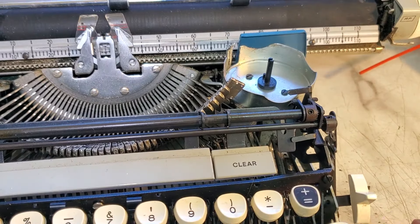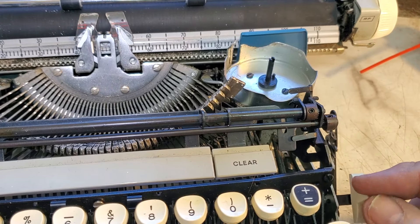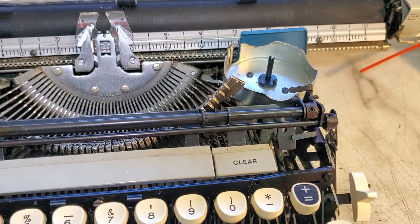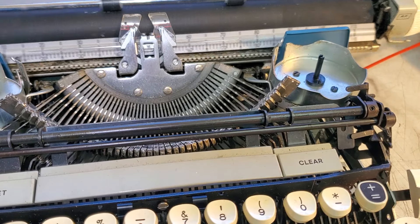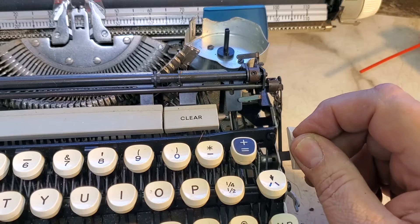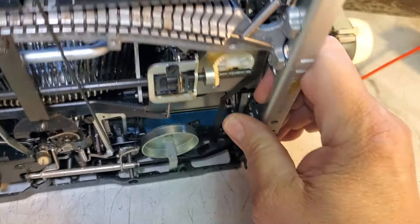Okay, it's in stencil right now — nothing, black, red. That was a sticky part, how about that! It's not that common for Smith Coronas to have sticking there. Some of these type bars are sticking a bit too — not too bad but the whole machine needs to be cleaned. So when the ribbon doesn't move, you have to look at the mechanism and follow the linkage like I did, to see where it goes and what's happening.